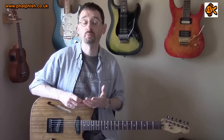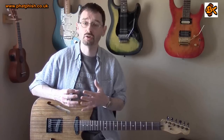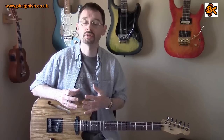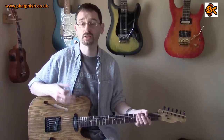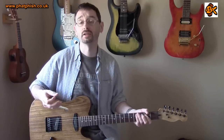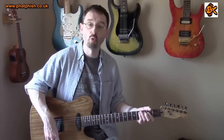This is the main reason a lot of people take standard single coil pickups out of their guitars and replace them with humbuckers. It's not so much to change the sound but to get rid of the electrical hum that particularly plagues single coil pickups — it's kind of the price you pay. Single coil pickups have a nice bright sound but they are quite susceptible to hum. Humbuckers, on the other hand, you lose some of the hum but the sound changes — you get something a little bit fatter and a little bit warmer.